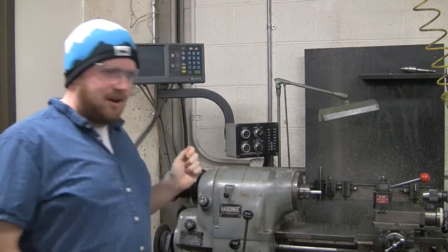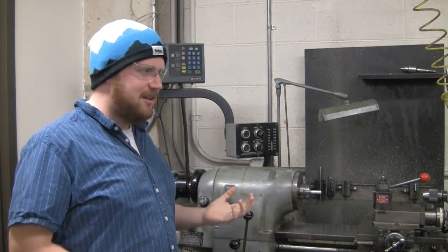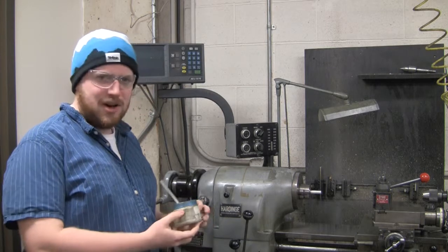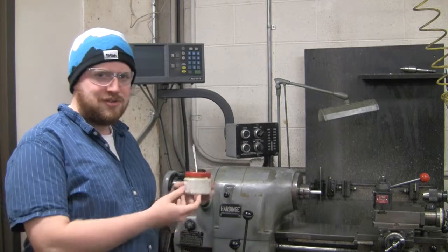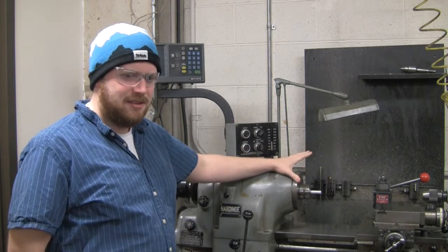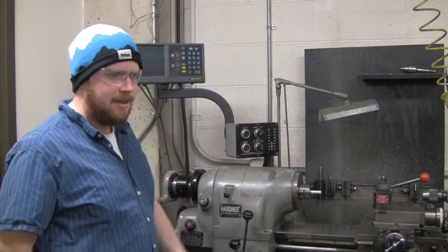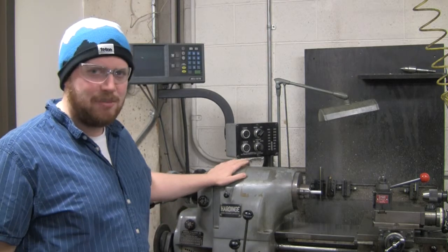So, when you've got loose clothing also, don't wear like a sweatshirt or something like that. You don't want any loose clothing that could be caught. When you're cutting your tool, you want to use lubricant for aluminum. Find the bottles with the blue handle around them. Or for steel, you want to use the red ones. In terms of the part, after cutting and during cutting, don't touch it because it'll be hot. Any chips that fall off, don't touch that immediately when the tool is running either. Or a drill bit, or even the tool. All of those get very hot during operation.